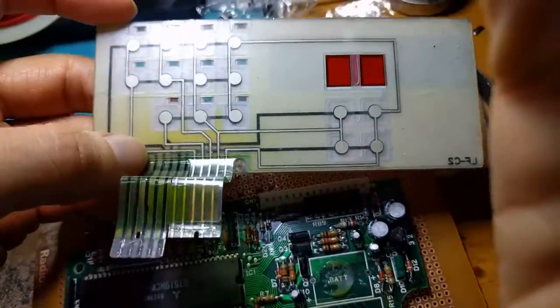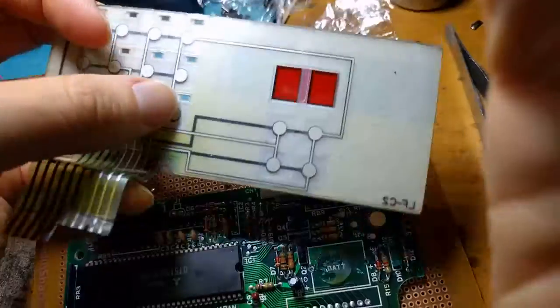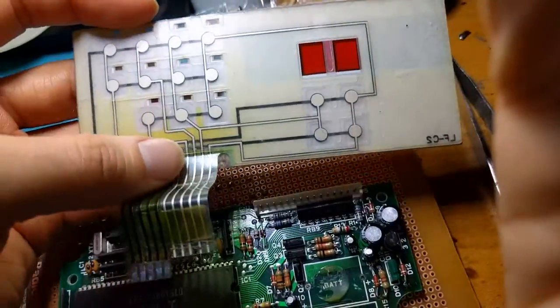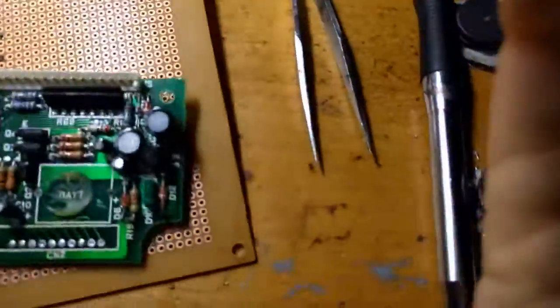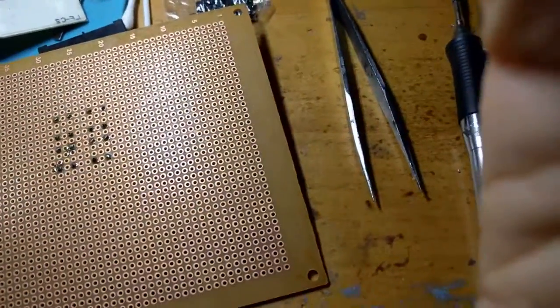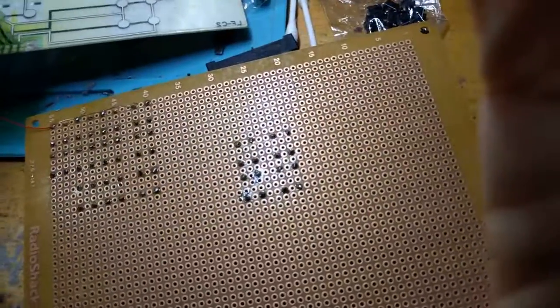And so what I'm doing is actually creating an alternative. Rather than trying to fix this ridiculous ribbon setup, I'm never going to, of course, get another one of these. Seems unlikely. So what I'm going to do instead is build a tactile push button interface with a standard connector, say something like this, a JST or a Molex. I usually go for JST over Molex since I prefer metric measurements over imperial.